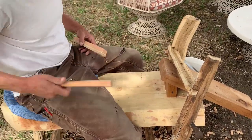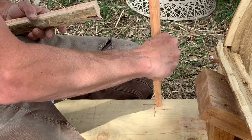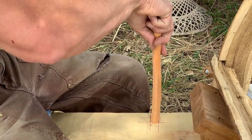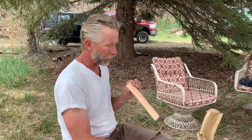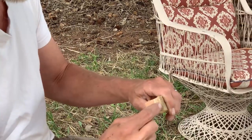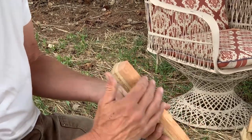You can see here on the bench that I've laid marks at three-quarters of an inch, which tell me if my pin is going to fit into the eventual holes. I've got a narrow end that's going to feed easily into the holes that I bore, and then the wide end which should be right around three-quarters — maybe just a hair fatter — to make these joints nice and tight. In the wood we have heartwood and sapwood; the heartwood is stronger, so we're going to take most of the material out of the sapwood so the majority of the peg is heartwood.